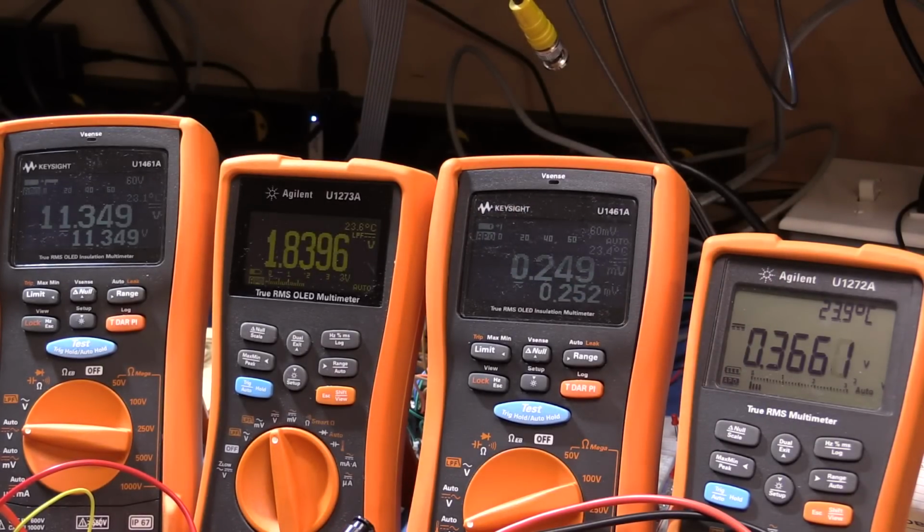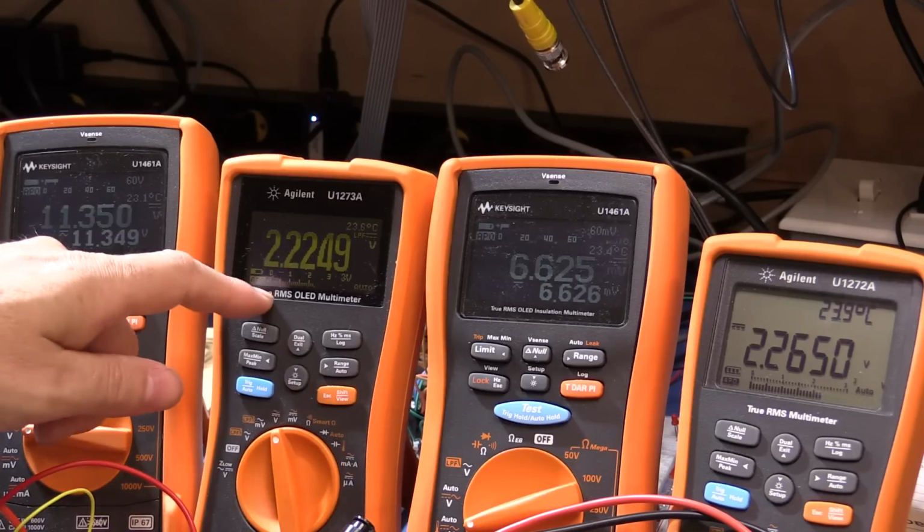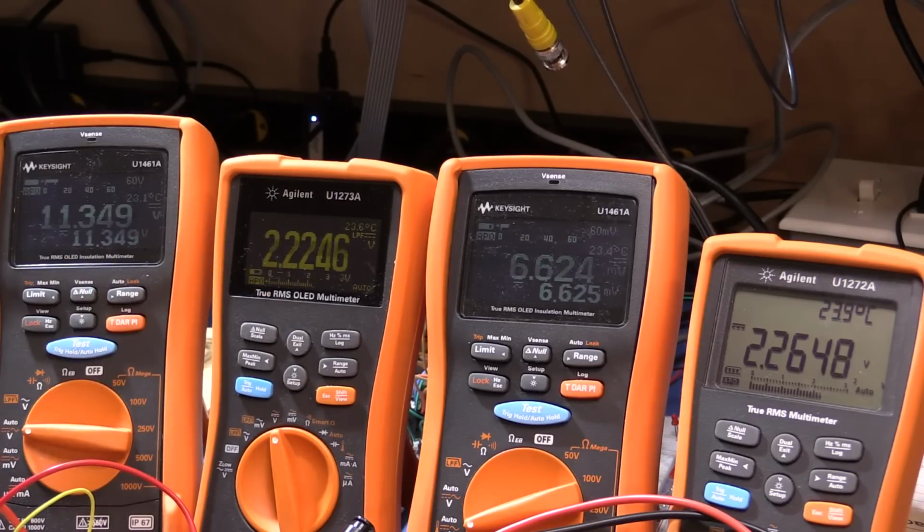It's not a lot at all, because I've set both of these to 0. Now if I start increasing the current, you can see the voltage is being allowed to come up there. The voltage control is still sitting high because I've got it set to maximum, so its error is huge, but because of the diodes, it's not allowing it to drive the MOSFET back on. It's all in the hands of this one, which is connected to the current output of the integrator.